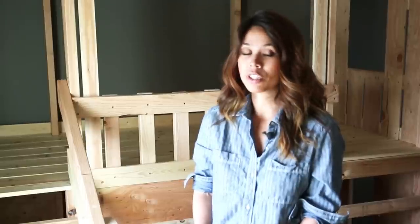We have nine-foot ceilings to work with in this basement, so we kept the height of the walls right at eight feet. This saved a lot of cutting. If you have an eight-foot ceiling, consider using stud-length two by fours for the legs.